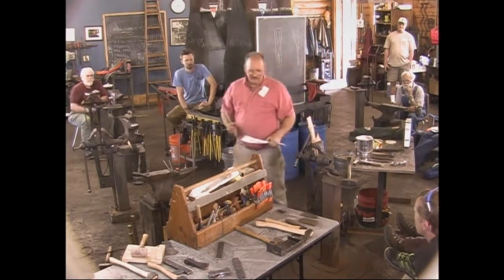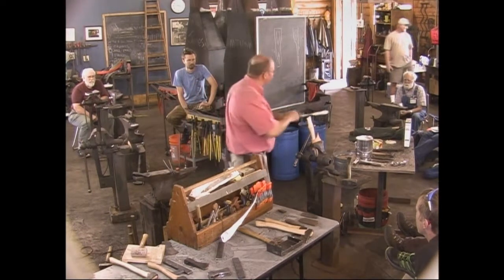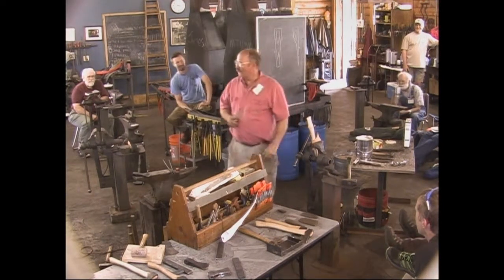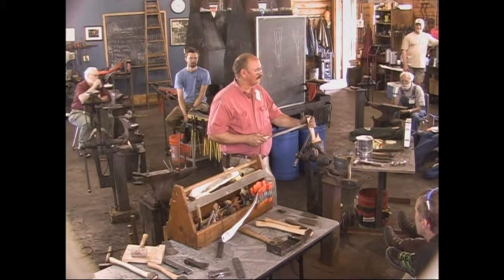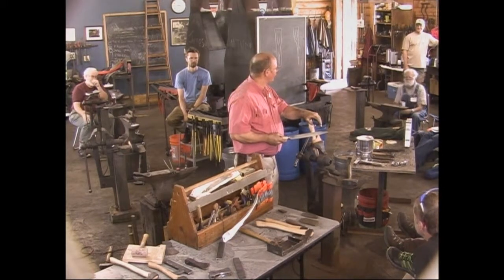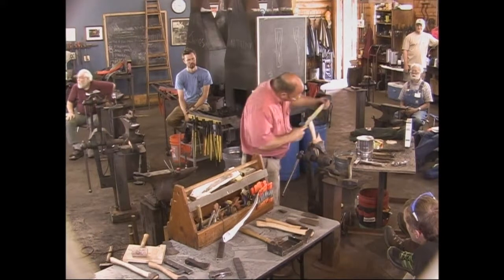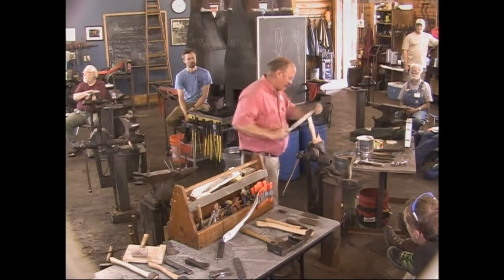These are French handmade rasps. They're forged, and a little guy with a chisel sits there in a vise and goes chip, chip, chip, chip, chip. There's a video on YouTube. Yes, and that's why I'm kind of a snob. They cut way faster and leave a way smoother finish than what you'd buy at Home Depot. That doesn't mean you need these for this kind of work, but I bought them for more finishy kind of work, and they're excellent for this as well. I just start to take the sides off where it was a little bit too fat, and we're going to go slow and test it.